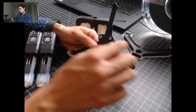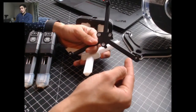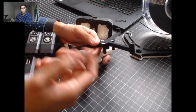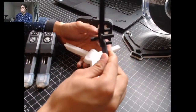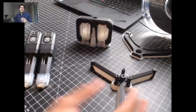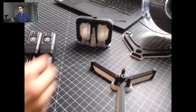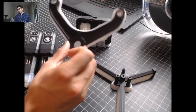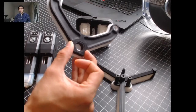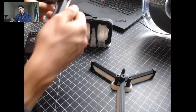And as you can see suggested here on the part, it's all filled up with soluble supports. If I'm not able to mechanically access those using breakaway, with a standard single material printer, it's just not going to be an option for more complex parts, right? So you might be able to get away with something fairly simple like this wishbone print, which only requires supports on the base of it, and I might be able to just peel it off and mechanically remove it.